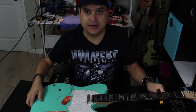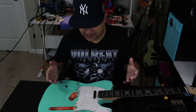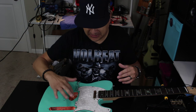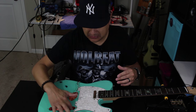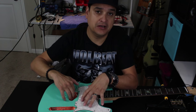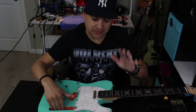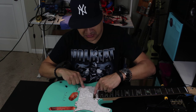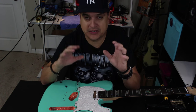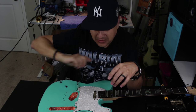When we take a guitar — I've got a Telecaster build here in front of me that I was going to shield this morning — I've done a couple of things. I've put copper shielding tape in the bridge pickup cavity and the control cavity. I will tell you, I believe it is more important to shield the area differently. What I did here is, instead of shielding just the cavity where the pickup is, I shielded the entire back of this pick guard, because what are we trying to do? We're trying to create more or less a satellite dish for all that EMI, putting it to the back of this pick guard and bleeding it off to ground.